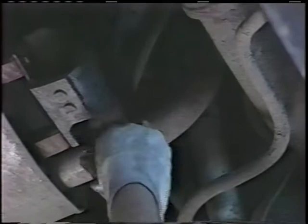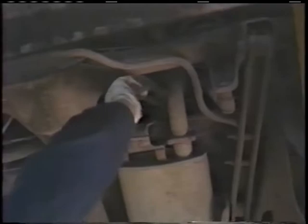We'll get back here, and we'll check the neck of the muffler, and we'll check these straps to make sure that these straps aren't rusted through or pulled through, and that the neck of the muffler is okay at the rear, that the tailpipe where it joins again, we have two pieces of metal joining, that's a good rust out point. And then follow the seam up and around the tailpipe and make sure that that's not rusted out.